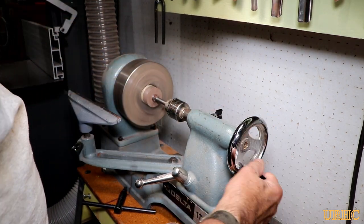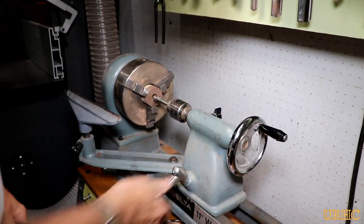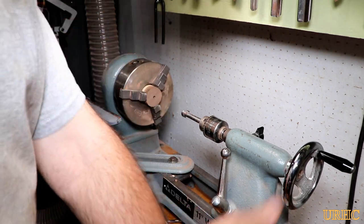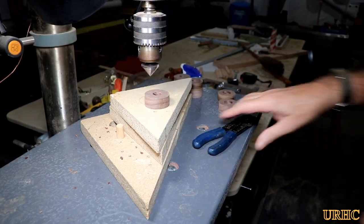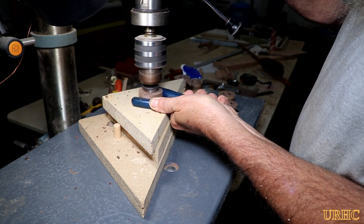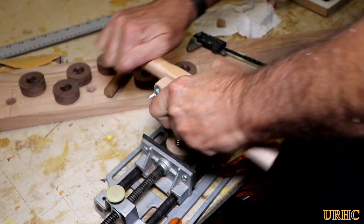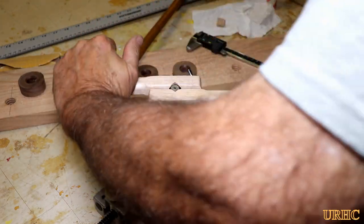Once the plugs were cut out I threw them in the lathe to drill a center hole — that's what would be tapped to match the thread on the peg pieces. The three-jaw chuck really helps center everything and switch out quickly, and a little piece of backing wood keeps it from tearing out. Then I put the same countersink in there to keep the thread from tearing it out. I used the rubber handles of a wire crimper set to keep them from spinning around — it was the easiest way to grip them.